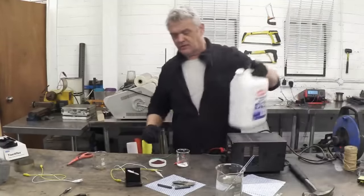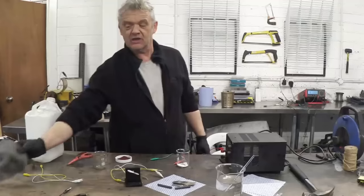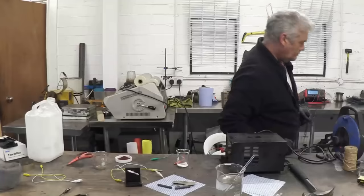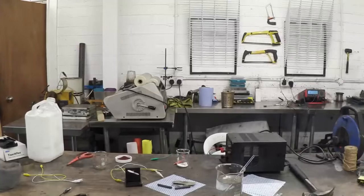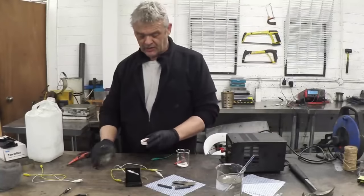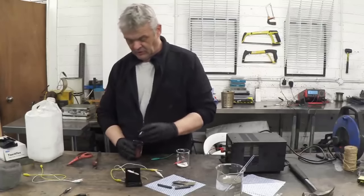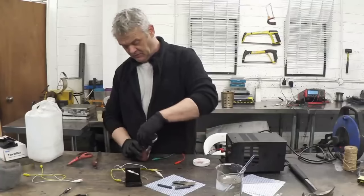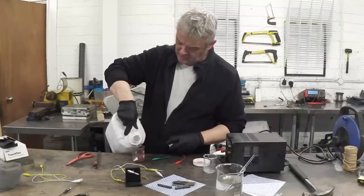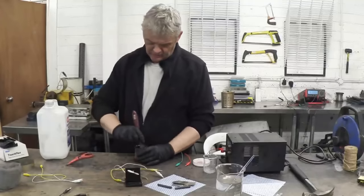So what we're going to do is mix up our Lalande paste, and we're going to smear it onto a bit of wire wool, give it some time to dry, wrap it around the carbon electrode. What I'm looking for is a stirrer. Wrap it around the carbon electrode and then see how it runs as a battery. So that's my copper oxide, magnesium chloride, magnesium oxide, and a little bit of water. Perhaps not quite that much water. And then give it a stir into a paste.